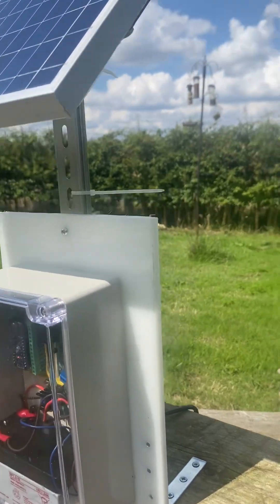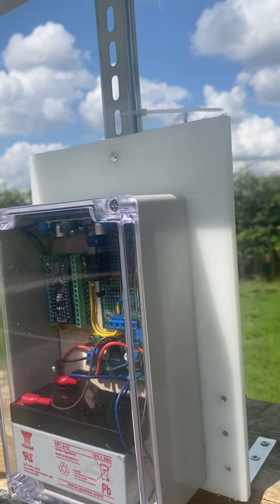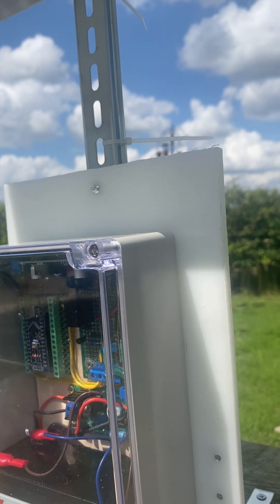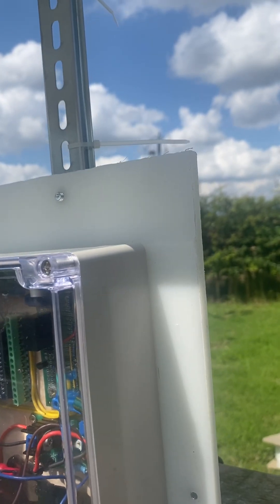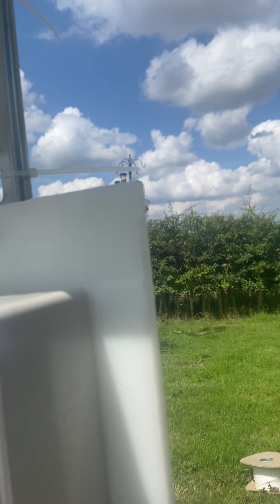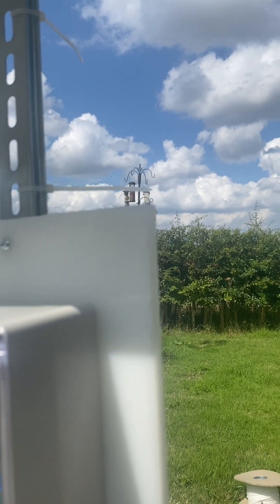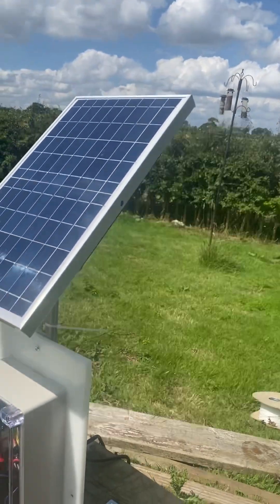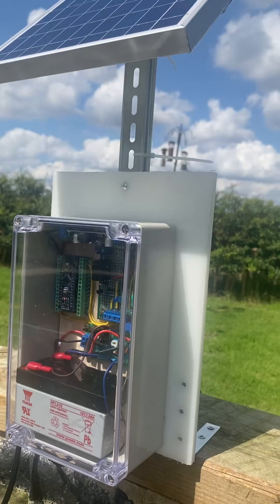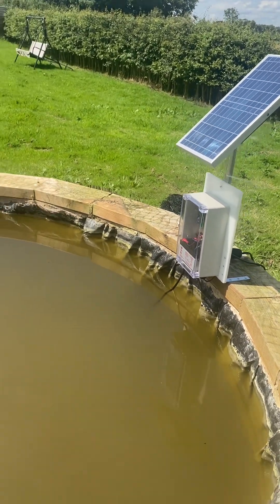This is the solar system - the solar panel charges it up. Inside the control panel we've got a homemade solar charging circuit and an Arduino that does the timer. It also has a light sensor that detects daylight, so the pump only runs during the day. It also only runs when there's enough battery power - we've got a voltage divider that divides the 12 volts by three, monitoring at four volts, and if it dips below four volts we don't run the pump, allowing it to recharge. The solar panel is 10 or 20 watts. The power supply uses a buck converter, which is more efficient than the Arduino's onboard linear regulator.